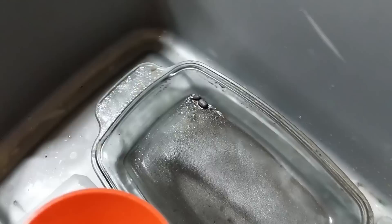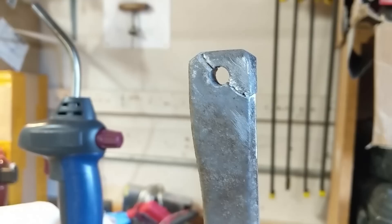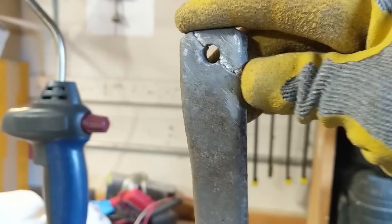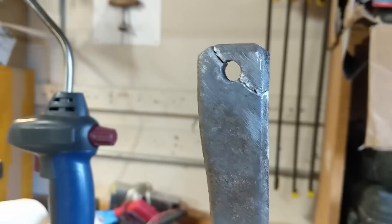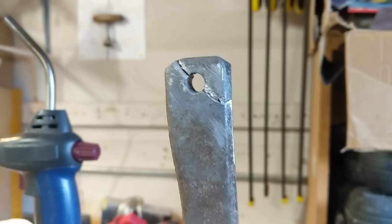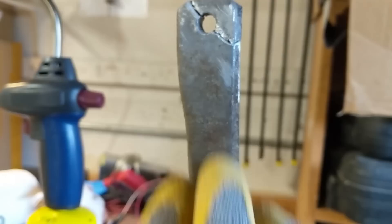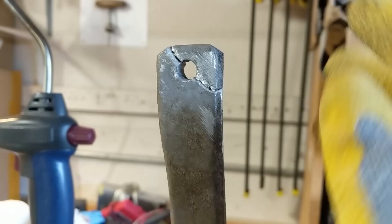You can see the two slugs — that's what's left of the bolts. The next problem is this broken piece that I want to reattach. I tried using an aluminum brazing rod with map gas on a plumber's torch — it works to get the brazing to stick to the small piece, but the lower piece is just such a heat sink, sucking all the heat away. So it won't stick to the lower portion. I need another solution.